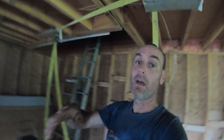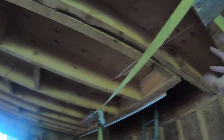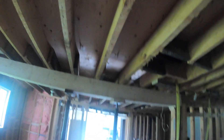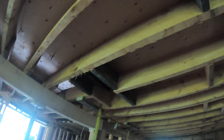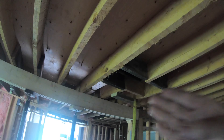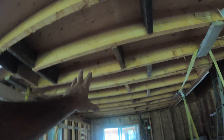I will sit my temporary beam right underneath that corner to make everything straight, and after that I will build a beam in place. I will remove this piece here and also this one which is useless. I will laminate at least three ply because it's holding the entire northeast section. I'll probably do the same here — remove this piece and build a laminated beam up there, at least two or three ply. I will cut the nails with the grinder and make sure the supporting walls upstairs are supported down here.